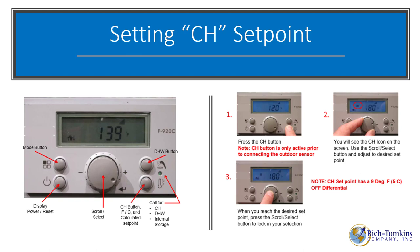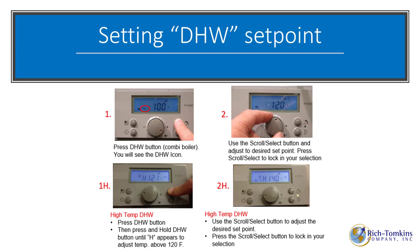To set up central heating temperature: turn the display on, select central heating using the thermometer button, then use the center scroll button to select your desired temperature and press it in to confirm. The same process applies for DHW — press the DHW button, scroll to desired temperature, and select. To access high-temp DHW above 120 degrees, hold the DHW button for about five seconds until a high 'H' indicator appears, then scroll up to 140 degrees.